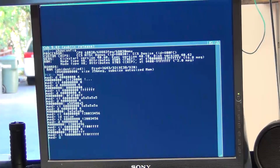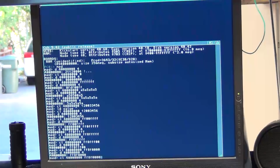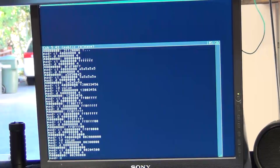Testing further nibbles and the high bit — those all seem to be working. In the end, what I found is that this particular bit, when set, doesn't allow us to change some of the other bits. For example, I wanted to write 0x20, 0x4500 — the 0x45 wasn't accepted by the memory. That led me to track down what's special about this particular bit. This is bit 21, and it specifically seems to have some weird effect on write actions to memory. I then went to my oscilloscope and tried writing that bit just to see what would happen.